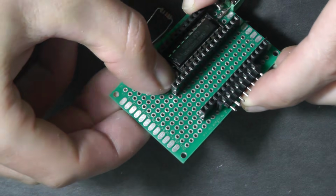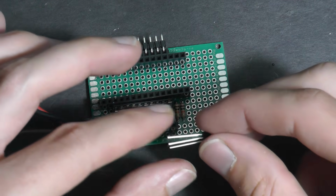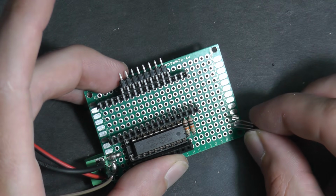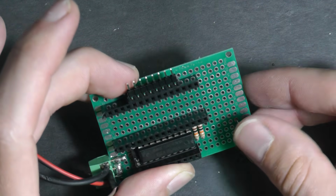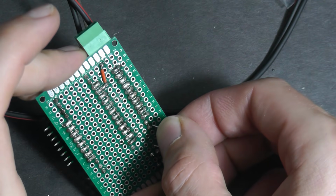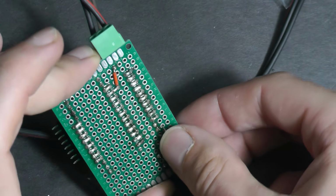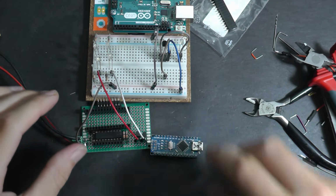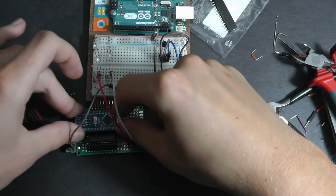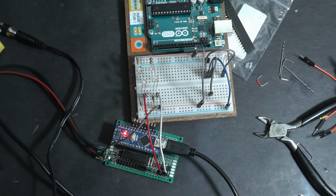I have more parallel circuits than transistors, so I need to add 2 more for the engines. This small one is actually included 8 times in the transistor field. It is the black chip. The blue board is an Arduino Nano. This is the brain of the whole project, and you can program any functionality you want with a computer.